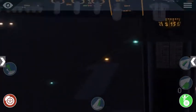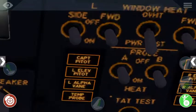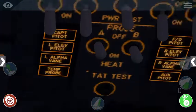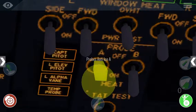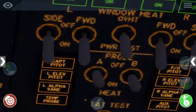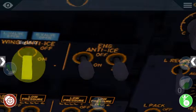Our APU is not on yet but we'll turn it on in a couple minutes. We're just doing a quick check of the aircraft - we'll turn on our window heat here to make sure that the window heat is on. We'll check our probes A and B anti-icing, verify they're working, and we can turn those off for now. We'll check our wing and engine anti-ice here, verify that these guys are working, and they are working so we'll turn those back off - we do not need those.